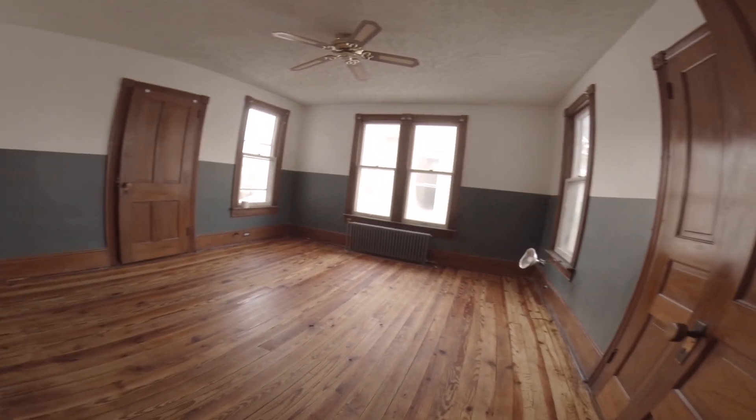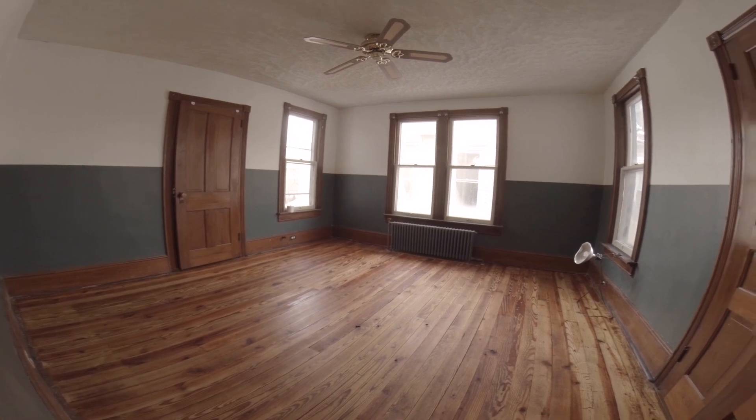It has been five days since we finished the job. The day after we came back and gave it a couple more coats. We ended up using a full gallon of mineral spirits and a full gallon of tung oil to finish this floor — so for a room around 10 by 13, you can expect to use about a gallon of each. I'm really happy with how it turned out. It has a really nice rich finish with a soft gloss. After finishing this one we both looked at each other and said we're doing all our floors like this — one down, about six to go.